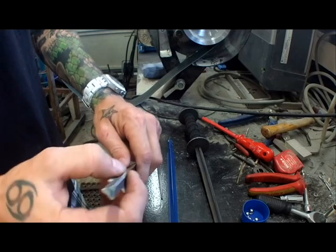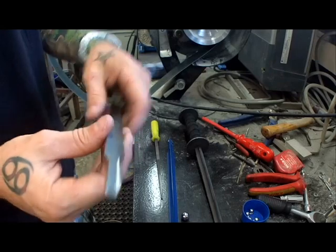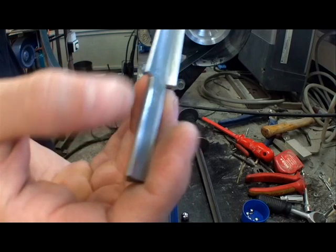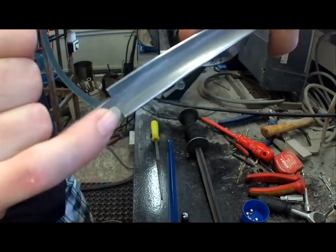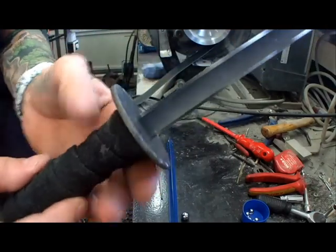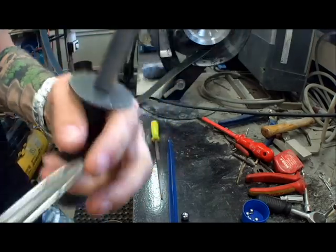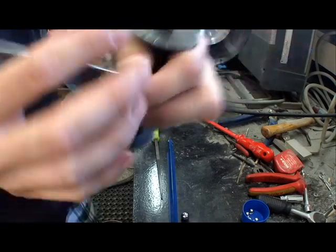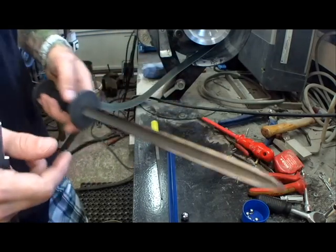Good thing about the triangle shape is you can put it in a lathe very well. It spins almost perfectly around. And what I did is I turned these three surfaces, and at the corner here I made a very sharp 90 degree corner. That's for fitting the rondels. So the rondels fit perfectly at the edge, because it gets pressure from all three corners, and that makes it very stable, nothing rattling, and it's meant for thrusting anyway.